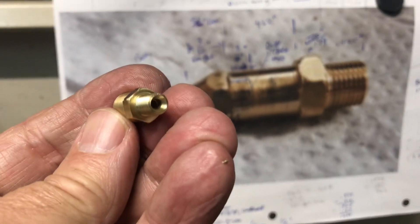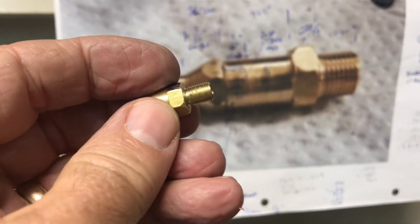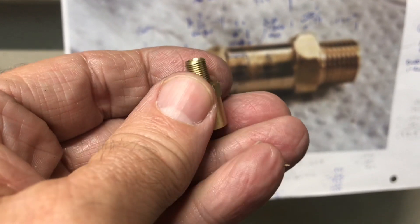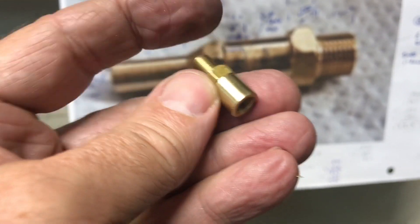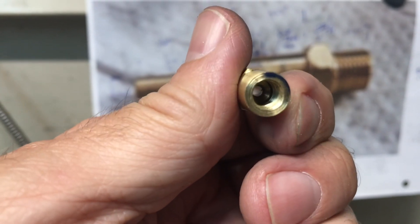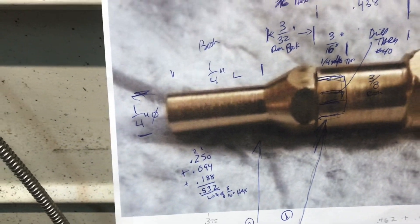You can see all my scribbling on it. Basically I had a piece of 3/8 inch hex brass. I turned down a 5/16 inch long portion of it, then made a nice undercut, and then I threaded a quarter by 40. I did a deep center drill for a connection there with a piping connection — that's where it'll connect to the wet header. Then I left a little portion here for a wrench, turned this part of the body, where my thumb is, down to 3/8 inch diameter, and the center part is threaded quarter by 40. So this is where the ball is going to be inside there, and I'll have to nick the inside of that so that the ball doesn't seat.